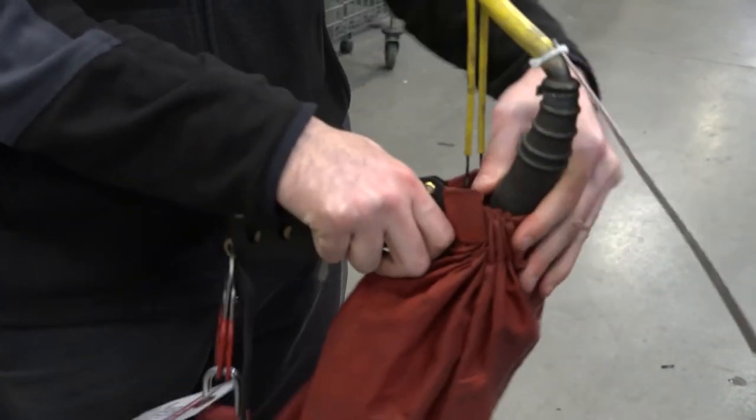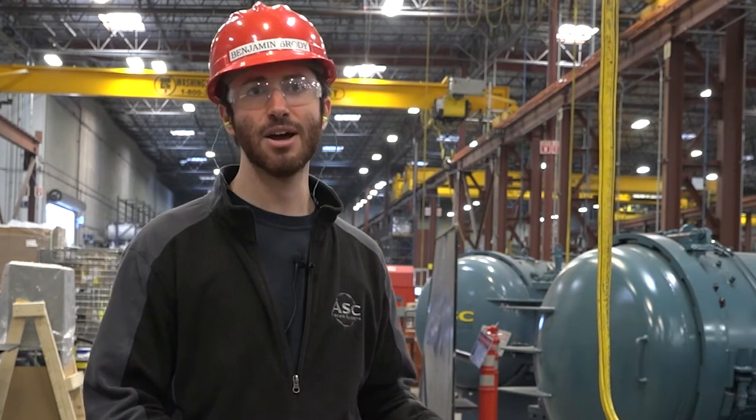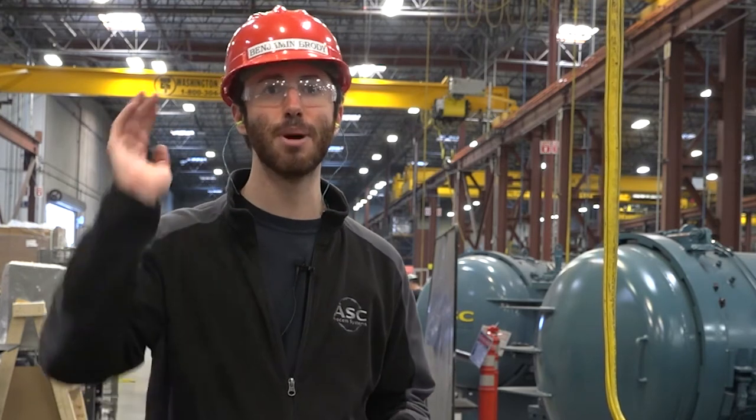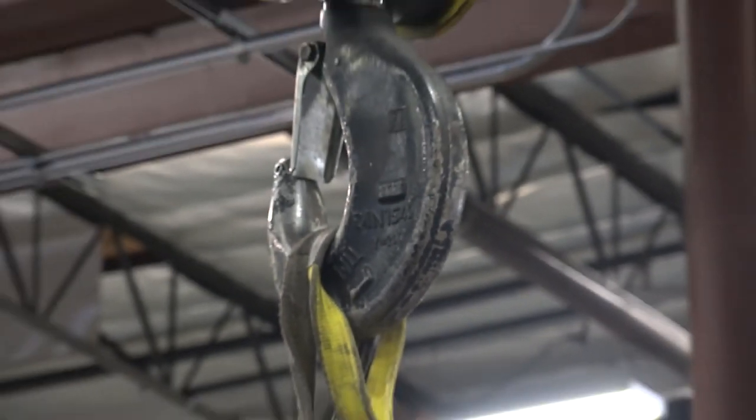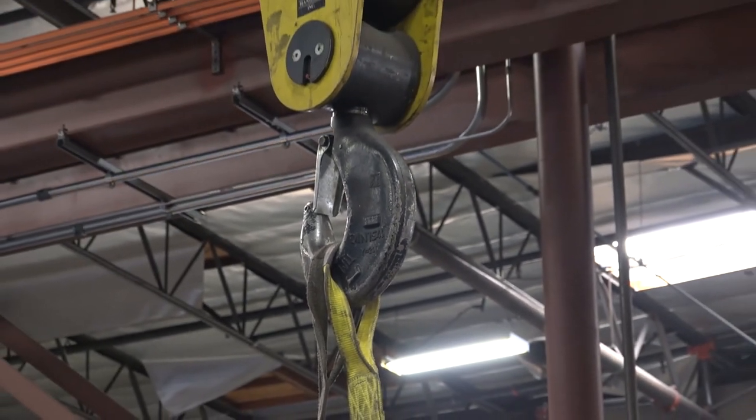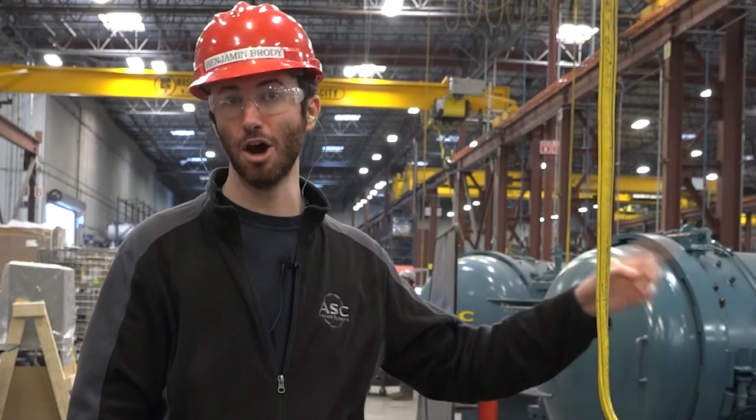Whenever you're using a crane as fall protection, you must use crane lockout tagout bags on the crane pendants on either side of you so that no one accidentally takes that crane and bumps it into you while you're attached to your crane with your safety harness. Another situation for using the lockout tagout bag is when you leave the crane attached to something for fit-up or final welding and you don't want someone grabbing that crane by accident and moving it, dragging your object along unknowingly.